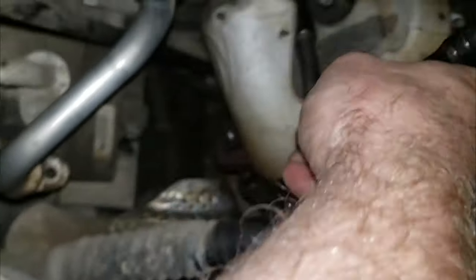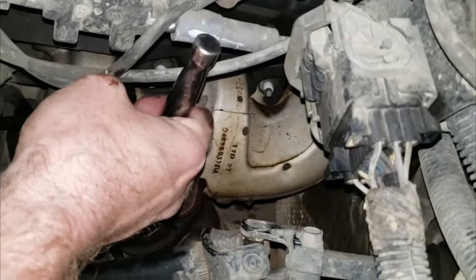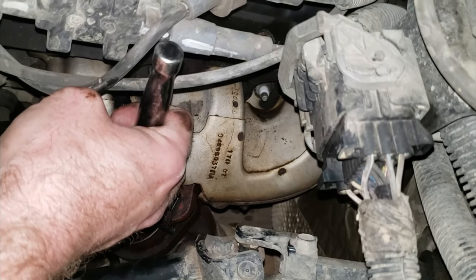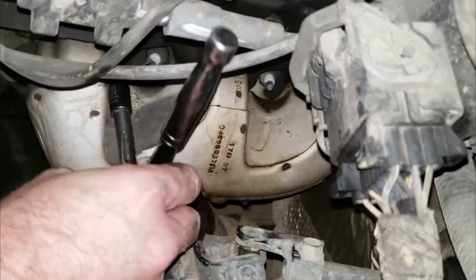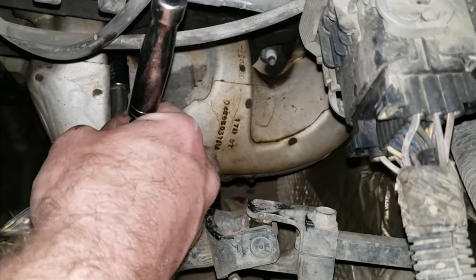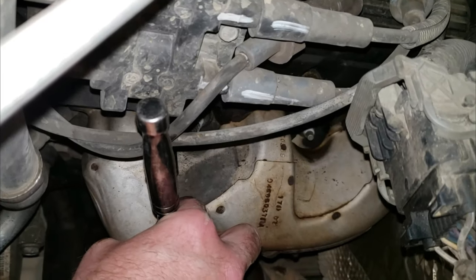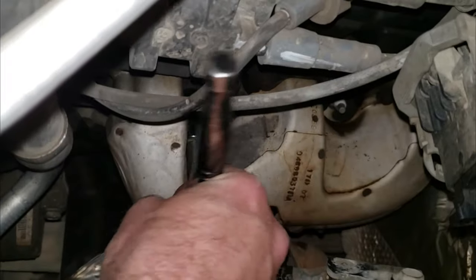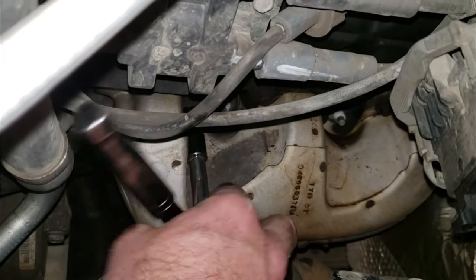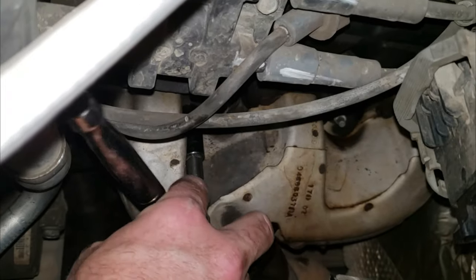To me, I think it's the right thing to do — I'm gonna crank on this backwards just a little bit. There we go, it starts to go. I'm gonna tighten that back up. I did soak these with penetrating oil for about two hours. So a little bit back, a little bit forward — I just keep repeating that until I feel that it's super loose.